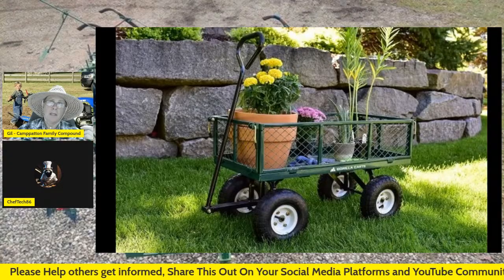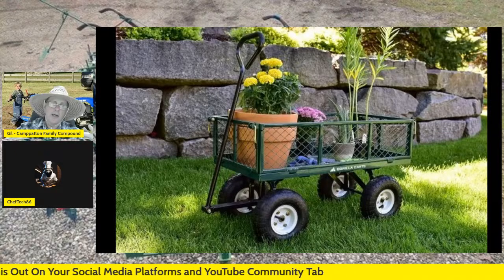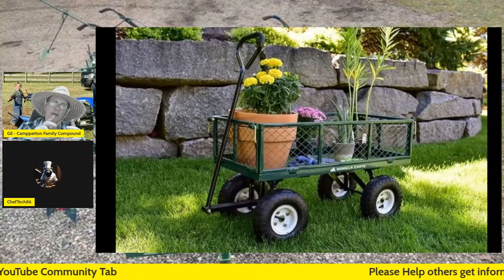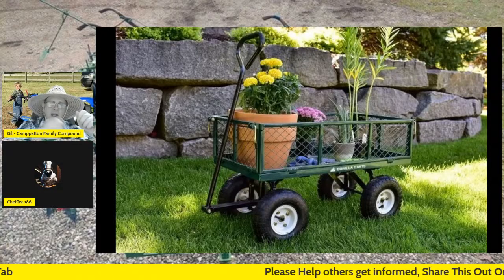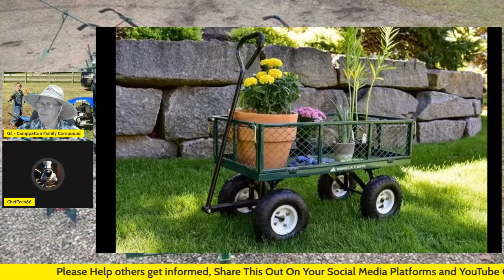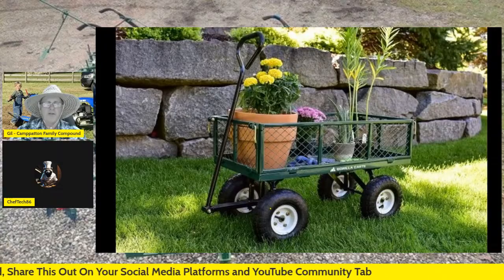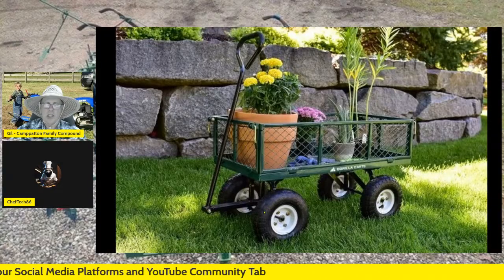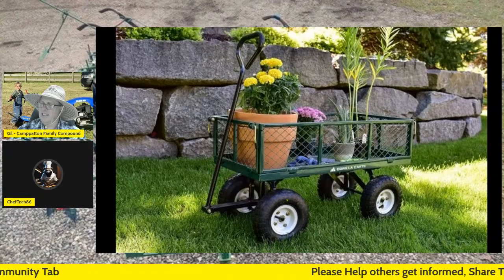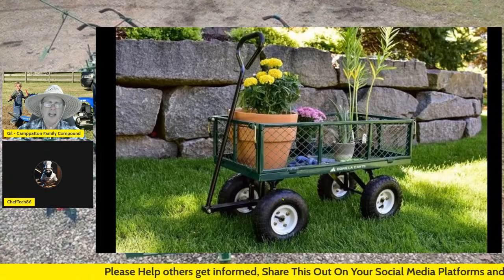Someone did that. Basically, they took a 1/4-inch drill bit, drilled several holes around it, stuck the foam in there, and started filling it up. They went from hole to hole, and any extra came out, and they just cut that off. Give it a place to vent out and fill up all the voids, let it harden, and cut it off. But on mine, it's so old the rubber is falling totally apart. You just need things that are round that rotate on good bearings. You could do it with pieces of wood if you want. It'd probably work better than the current tires I have on it.